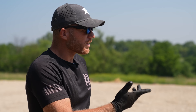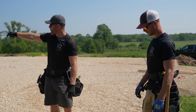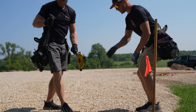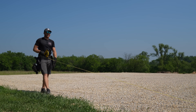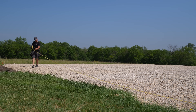We don't have setback issues here, but if you need to line up with something - say there's a house behind you and you want to be parallel to it - you're going to want to measure off and stay consistently those dimensions off of that house for your starting point. That line becomes your control point. We'll simulate that here: we measure from our pin to whatever we're paralleling up against, then pull the tape to the same measurement at the other end.